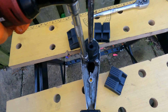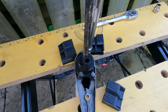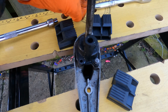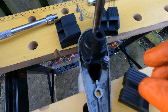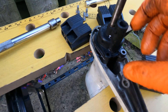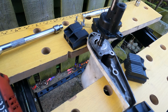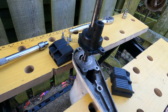This is just as simple — just start each one off. It's a tiny pump so the bolts aren't torqued massively, and they don't need to be tightened to the death when you reinstall them — there's only three and they're only small. That's it ready to come off. We'll just lift the whole thing off. It looks like the impeller's coming off with the top, which is what normally happens.